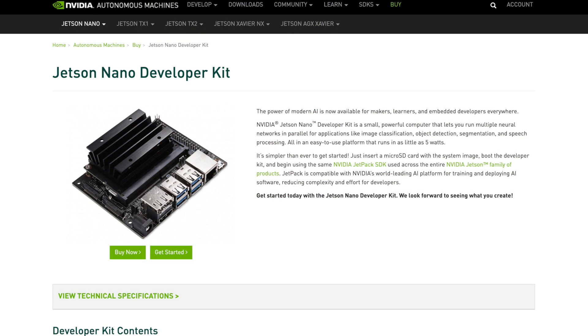Already we're looking at different hardware platforms. This is running on Raspberry Pi for now, but there's something from NVIDIA - a similar all-in-one computing board called the Jetson Nano which is a lot faster. It has a 128-core GPU making it extremely quick at encoding video, so if you use that - and they're in testing stages at the moment - the latency glass-to-glass comes down to about 40 to 50 milliseconds, which is still not down to DJI but obviously a lot closer. The developers tell me they could potentially use some sort of FPGA solution which would bring it down to DJI levels of latency. They haven't got there yet but it's something to look at.